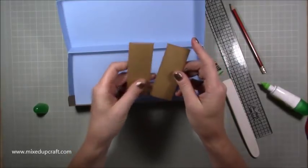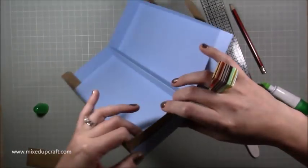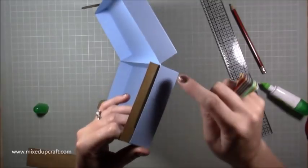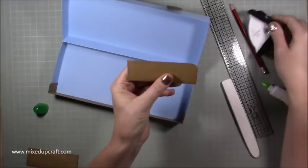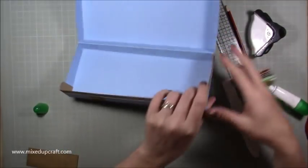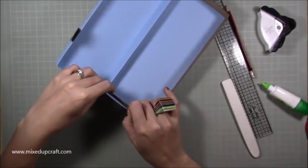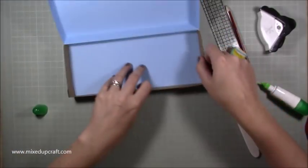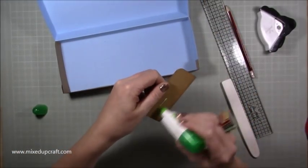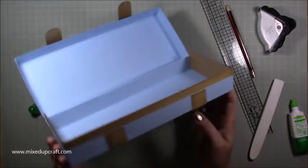There's still a little bow on the sides — that's why we need those two pieces that are four by one and a half to go inside the sides, sitting behind the closure piece. Round off the top corner of each — top right on one side, top left on the other — so the curved ends help the side pieces glide in nicely. Add glue up to one inch and get those stuck down. Now you've got a really nice right angle and a nice straight base to your box.